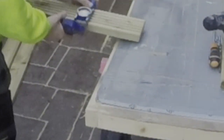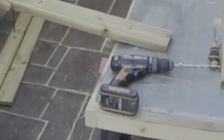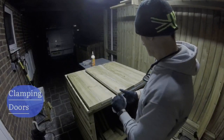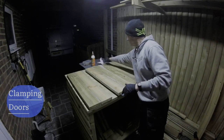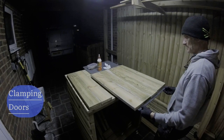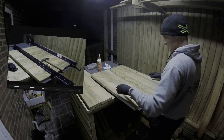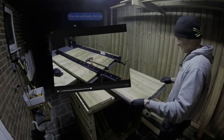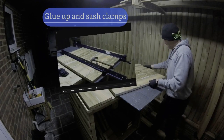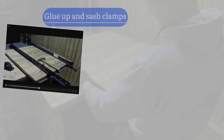I'm going to do two double doors with a stopper behind so we have the full width - nothing in the middle - to give us loads of room inside. These are the doors; I'll cut them into the dimensions later, cut in half and sized. You can see the sash clamps - I've clamped one side with three or four boards and the other side with two, and I'll be clamping them all together, gluing them with the sash clamps. You can see them there. They'll be clamped up tight and left for 24 hours to dry, giving me a solid piece of sheet material.